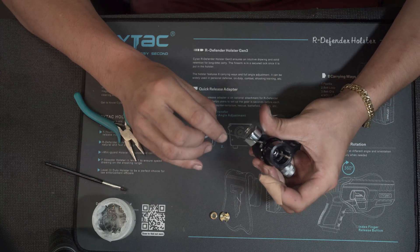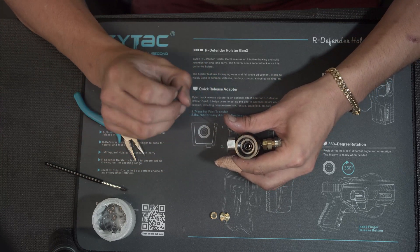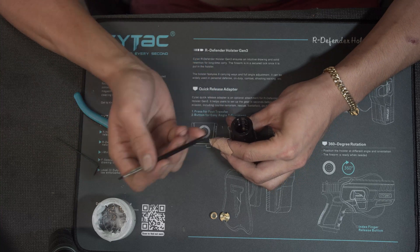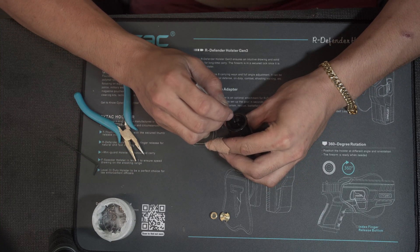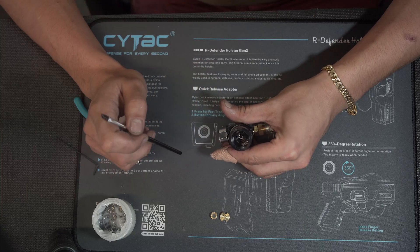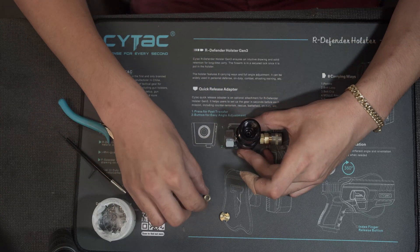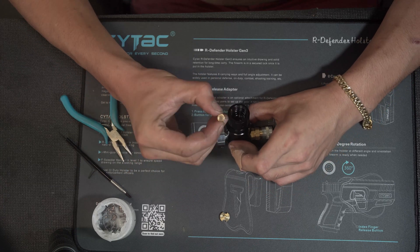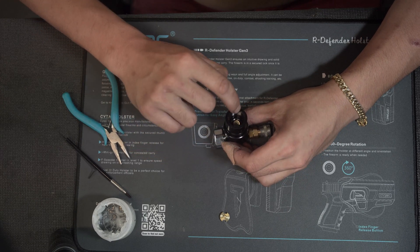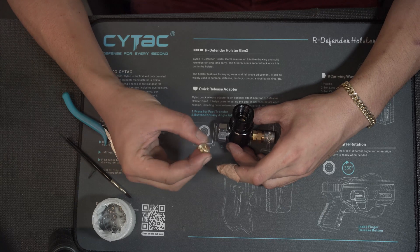In that process, I've actually moved the o-ring so it's sitting up a bit, so I grab my paintbrush or the end of it and just push it back down. You want it to sit around the rod — see that silver rod right in the middle? The o-ring sits around the rod. Next up, putting your blast cap with the o-ring sitting upward — straight in there. It should sit flush as well. And finally, putting your retainer cap on.